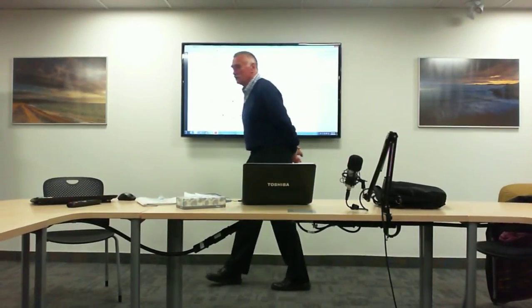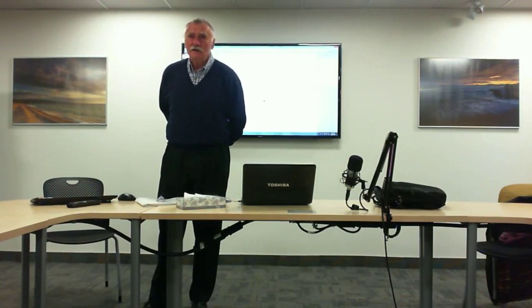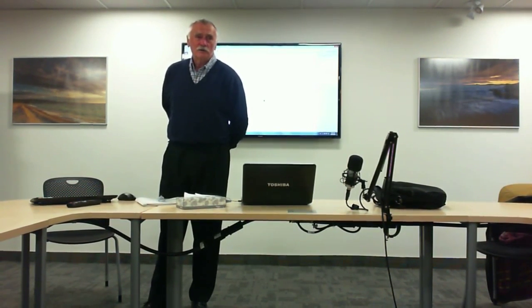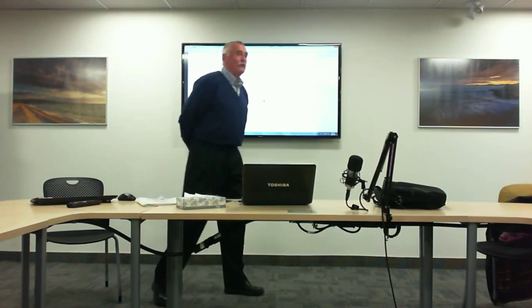Well, Armstrong, as he went through the ranks, one time became Major Armstrong, and he improved the vacuum tube amplifier and the vacuum tube oscillator. He improved the autodyne. And finally, he came up with a solution which says that it's best if the radio performs all of the necessary amplification and all of the necessary filtering all at the same frequency, regardless of what frequency we want to receive.